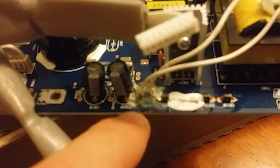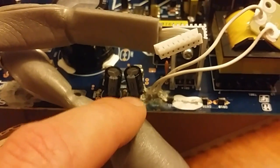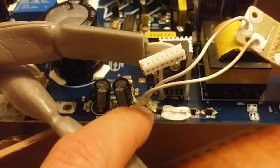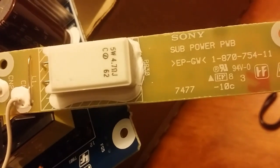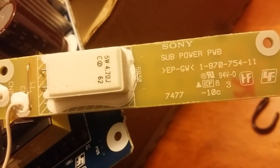I know it's a little blurry, but here's the little chip that I desoldered — a tiny little thing. His board had the very same resistor right here behind it for his R830. Mine has a separate board, and it does say R830, 4.7 ohms, 5 watts.